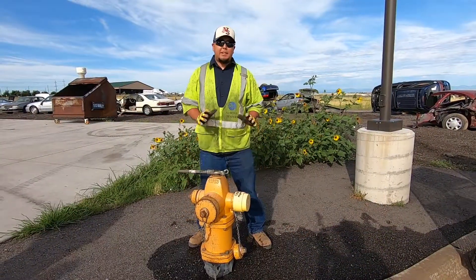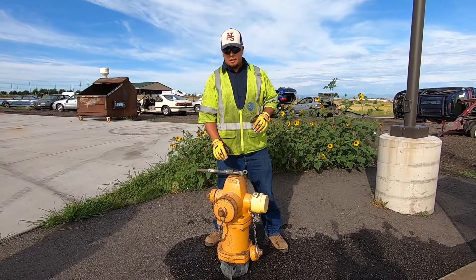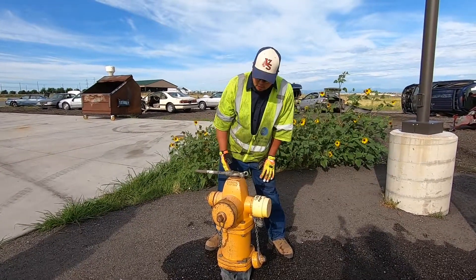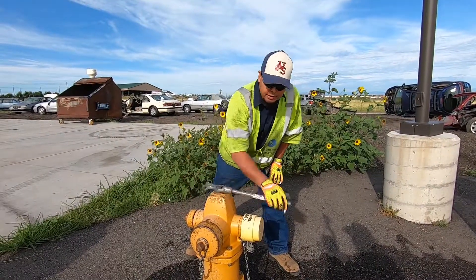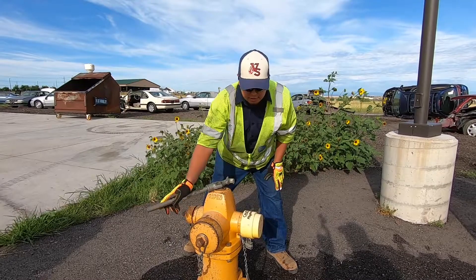One of the biggest things to remember: if you pull up to this fire hydrant, you need to know it is in service and can be used. But when this recorder is on there, the hydrant is pressurized, so the first thing you want to do is turn the hydrant off before you do anything else. Otherwise it will shoot — this thing will shoot 50 yards down the way.